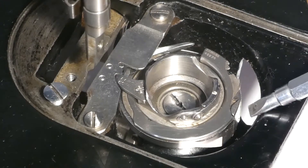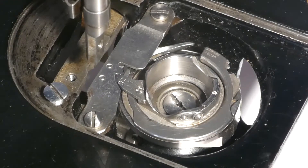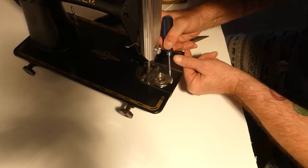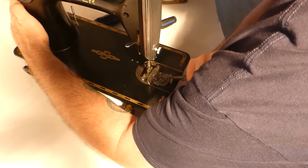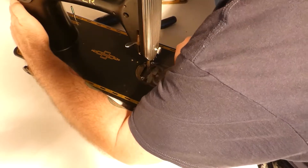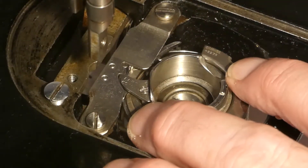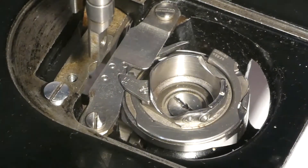So here is the spring. This spring has to ride over that bit there. Now to get it off, I move this spring back here, and it clicks and it stays there. And I have to push that forward like that. The nose of the needle nose pliers is just kind of out here. I put them right on the ridge.